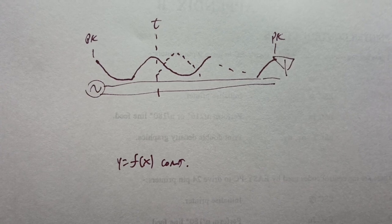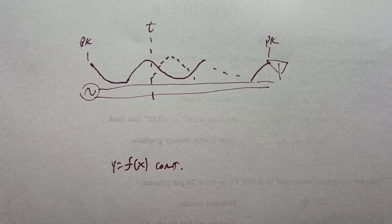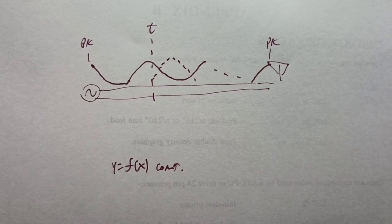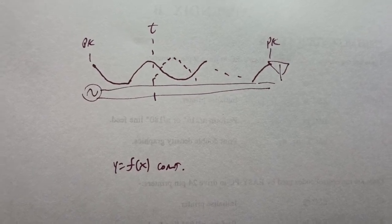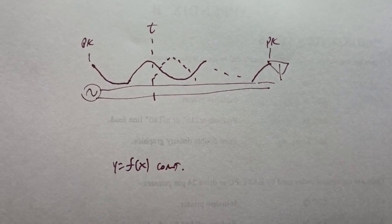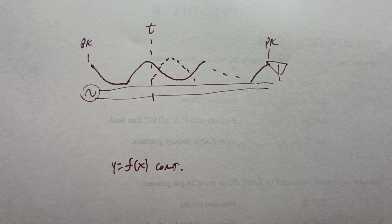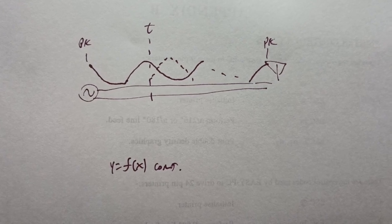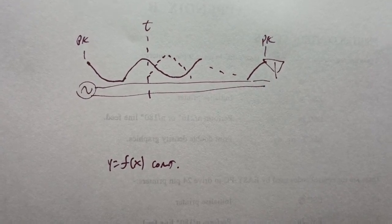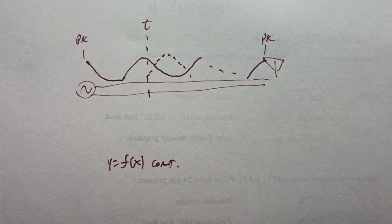But the beauty of this is suggested in what I've done and what Charles out in Washington State is doing right now. He's put up a dipole and he's rigging a nano at the feed point with a powered USB cable and a computer, and he's going to do feed point testing, and he's really getting into this. And in theory, this transmission line phasing would eliminate or reduce the need to measure at the feed point, or at least give as close as we can reasonably get to doing it at the feed point. That becomes very difficult when the antenna's at 60 feet.